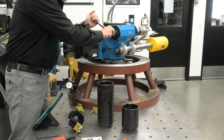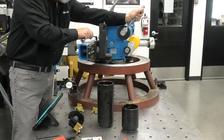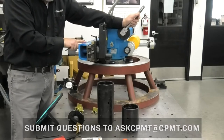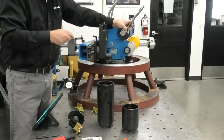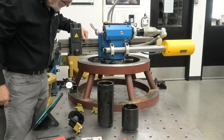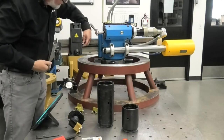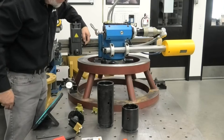On the back, you can see I have a locking mechanism so that I can lock the slide so that it doesn't feed in or out. I want to make sure that's loose if I'm going to do an operation, but if I'm doing something where I want the tool head to stay in an exact place, I'll go ahead and lock this down. But I have to remember that I don't want this locked while I'm moving. Likewise, on the tool head for the up and down, I have the ability to lock. Now this has a spring-loaded handle, so I can move it to a convenient position. I loosen it or lock it, and then if I need that to be out of the way, I can just pull it out and turn it. All of the thumb screws work the same way on this machine.